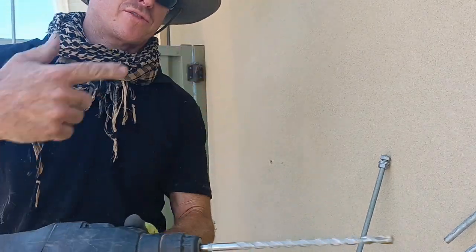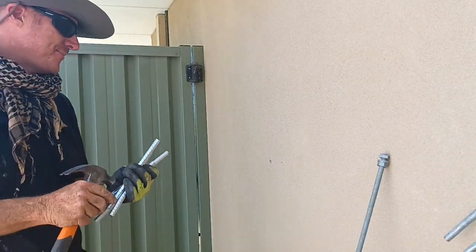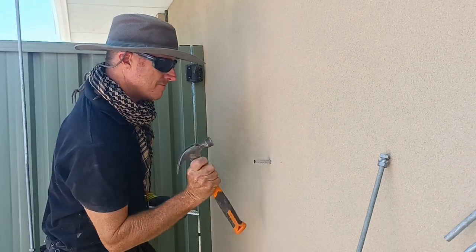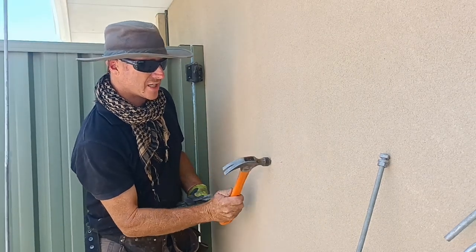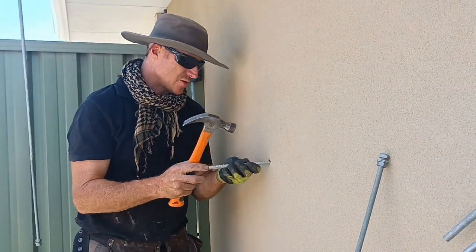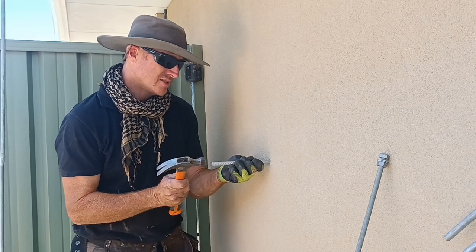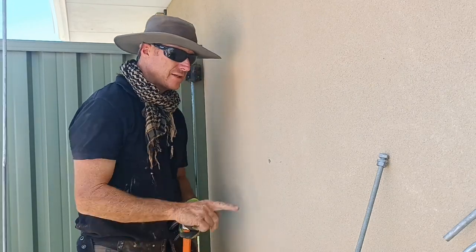That is not long enough to go through both walls but it will catch the other wall. 12mm rebar - put it in the 12mm hole I just drilled, knock him in. It's now going in the other brick. Once it gets flat, grab yourself another piece of 12mm rebar, knock him in about 10-20mm. So once we hook that, it's in both bricks. We'll patch that at the end, give it a little paint, you won't even notice that.